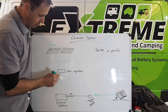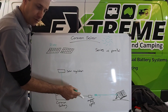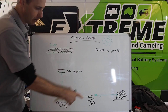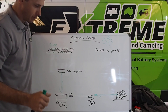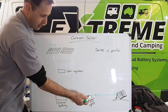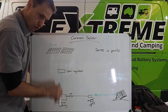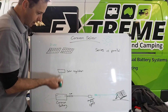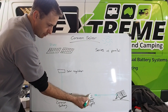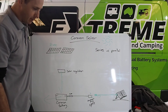So if the installed system is pumping in heaps of power and sitting on 14.4V, and you plug your fold-out solar panel in and it also sees 14.4V, it probably won't put anything in — there's a high chance it'll just back off and the average amperage will be quite low. That's been replicated many times when we've put shunts on it. The charge controller monitors the voltage at the battery. So if the sun disappears and you pull a big load, the voltage will drop. The installed regulator is pumping as much as it can, and that'll wake the fold-out regulator up as well, because it will see the voltage has dropped and it will ramp up and charge alongside it.